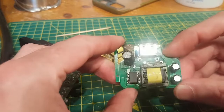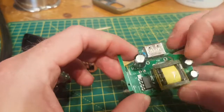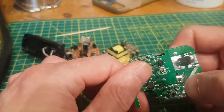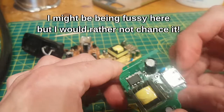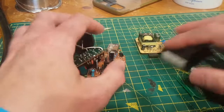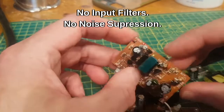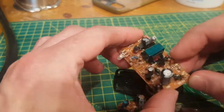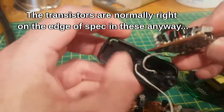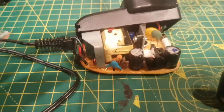This is a USB power supply — on the face of it, it looks okay. You've got a fuse coming in and a decent looking transformer. But the live wire has been cut quite close — really too close. And the USB power supply is connected to the shield on the USB connector. A lot of these don't have any inrush limiting, no protection against noise, and no protection for the switching transistors, leaving them vulnerable to shorting out. You really don't want to be leaving these on down the back of the sofa for any length of time.